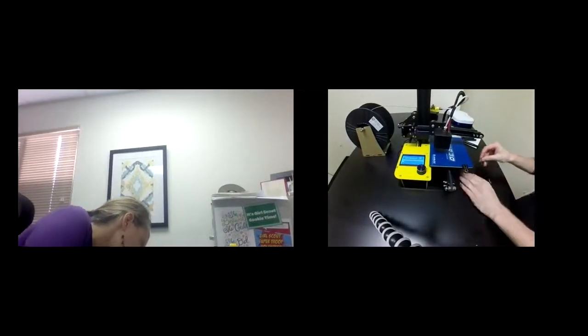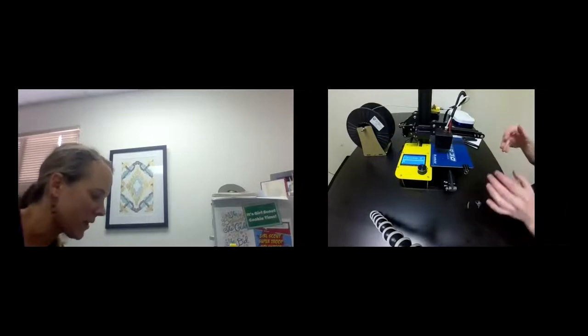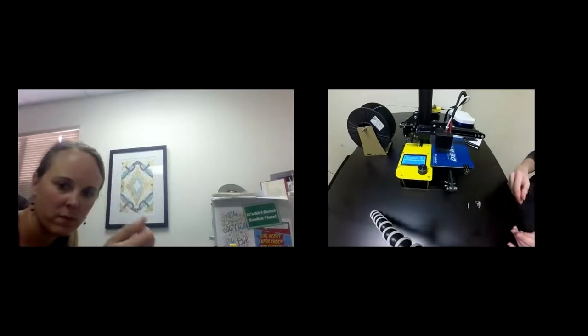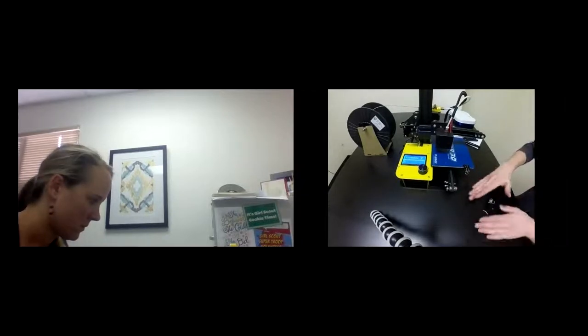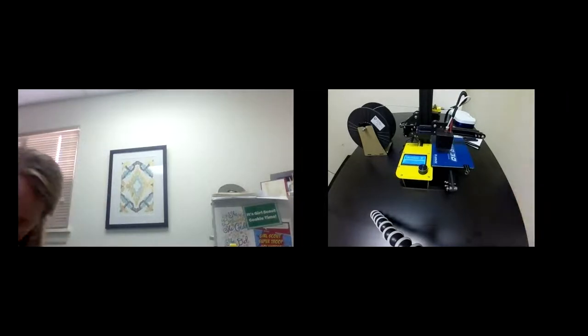Did yours change colors? I put yellow in and yellow was already in there so yellow came out. I think yellow was the test color. So what you can do now is schedule the print. We pushed the filament in, talked about the soft pull, pushed extra filament through to clear colors. Inside the tool kit there's a small needle — this is only used if you get a really bad clog to floss the nozzle when it's heated up. You'd raise the bar as high as possible and use pliers or tweezers to floss the nozzle in and out until you clear the clog.